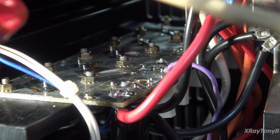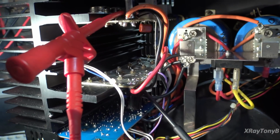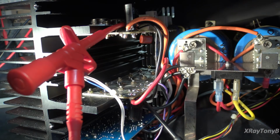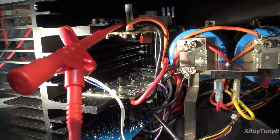So all we're going to do is transfer these wires from this upper board up here, that used to be up here, and transfer it down to here and mount it onto that board. Again, it's all the same heatsink. The temperature will be the same. It will work the same, and we don't have to try to dig that transistor out. We'll just use some of our thermal adhesive, put it in there, and everything will be good to go.